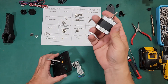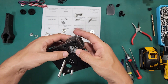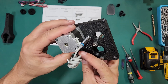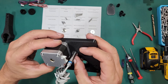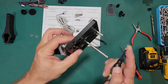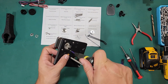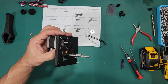Now it's time to install our motor. The important thing here is that we orient the motor facing the right direction — push it all the way towards the back and we want the connector facing forward or towards the proximity sensor. This is the best orientation I've found for running the wiring, and you'll see that towards the end as we connect all the wires and route them through the base. First put all four screws in — you don't want to put them in too tight. We're going to back this towards the rear for now; later we'll loosen it up and slide it forward until the gear engages fully.